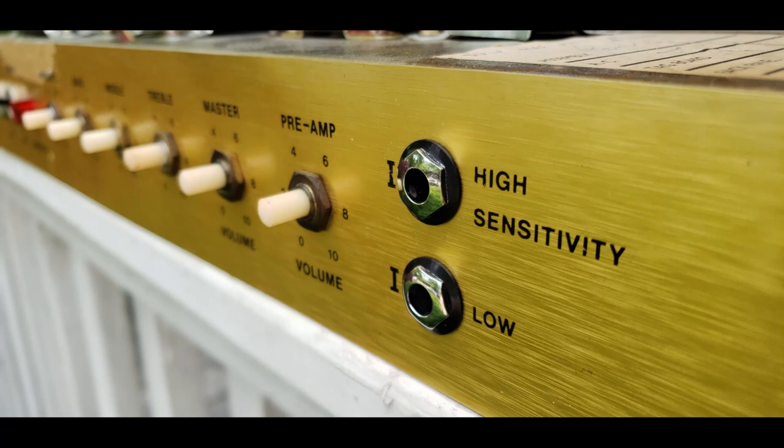In 1976, the 100 watt, the 2203, got cascaded gain stages, but the 2204, the 50 watt, had two individual channels borrowed from the 1987, a normal and a high treble. The labels on the front here that you see are kind of misleading. But then those channels were mixed together and going to a single preamp gain pot.